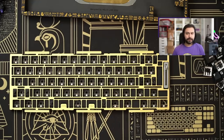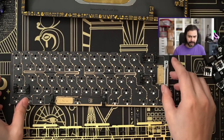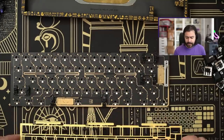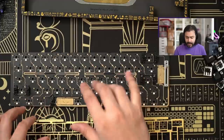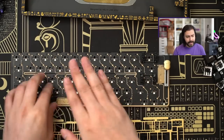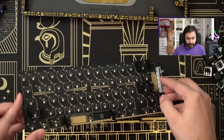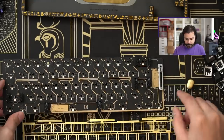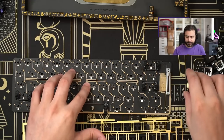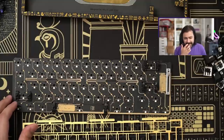All right, in terms of PCB and electricals, I said that on my unit, the slider is misaligned by like 0.2 millimeters. This can cause sound issues, by the way, especially if it starts contacting this, or if it's at an angle. The reason why the scarab makes the sound so rattly is because the entirety of the vibrations of the PCB basically radiate through this little point here. It acts as like a little tuning fork. So if you type and you touch this, you can feel everything. So loose scarab, kind of annoying. This being offset just the tiniest bit, also very annoying.